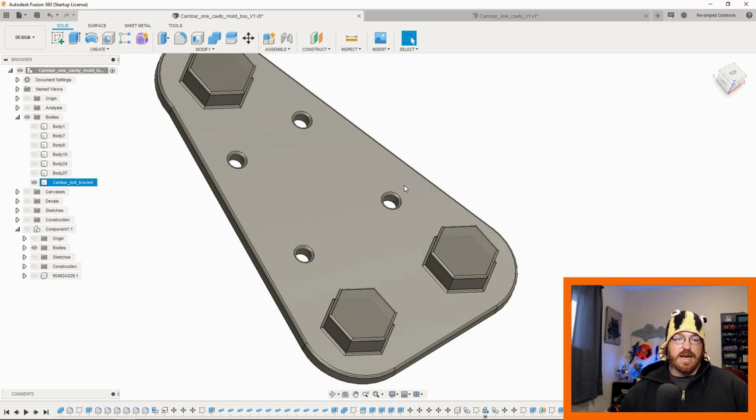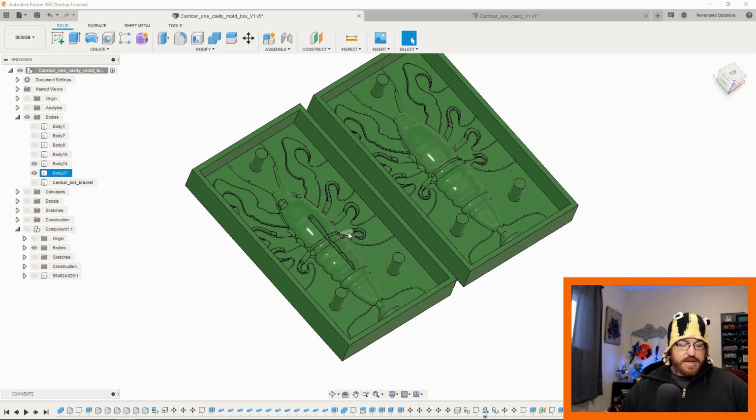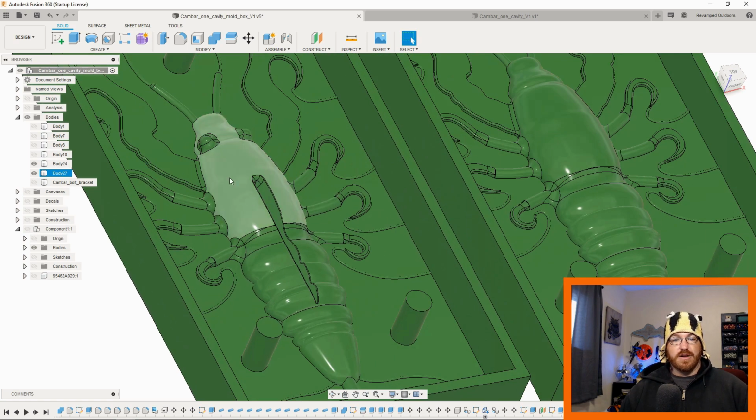We're going to use 1/2 inch wood with this, hopefully being 1/4 inch thick, or we're going to use 3/4 inch wood with some 3/4 inch screws or 1/2 inch screws. Put those in there. Our bolts are going to stay in our mold body every time we pour instead of having to put new bolts in, which is a huge pain. So that's essentially it. Not a crazy design. It's a little bit of a crazy design to make sure that all these fillets work. That's the hardest part. Anytime you have complex intersections, these fillets are a little bit difficult to work with.